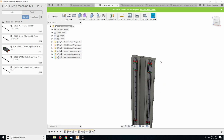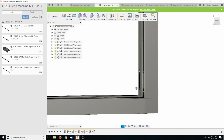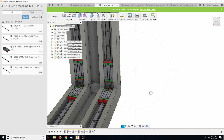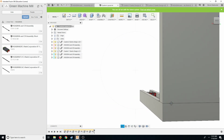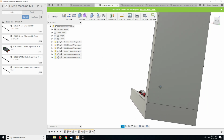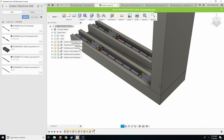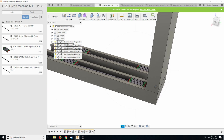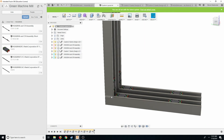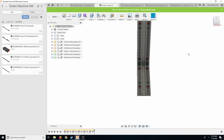And it's going to be machined anyways, but how I'm going to attach this stuff is going to be the interesting part. It needs to be held first to the point where it is square, and then I need to go in and weld here or whatever. So probably have some sort of bracket, and then mic everything out so it's square, and then come in, weld here, grind, weld there, grind, weld here, grind. So everything is nice and square with each other.